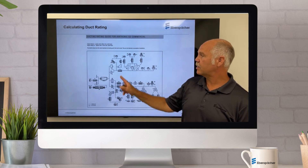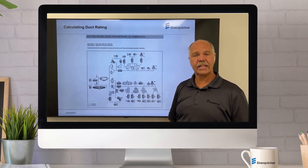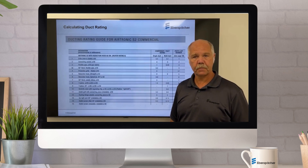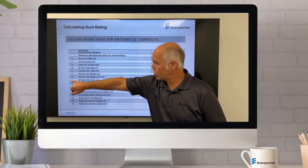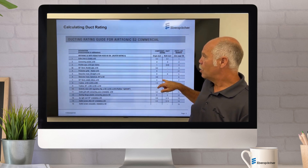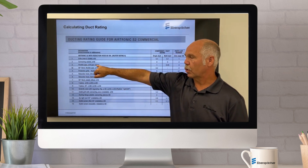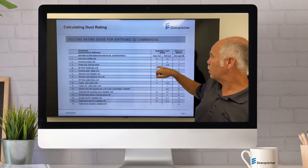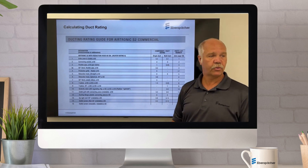You would take the numbers of the components off of a napkin sketch that you do prior to your installation, carry it over, and follow those numbers associated with the back pressure ratings. So as an example, if you had 60 millimeter ductwork, you carry it over — single duct is a 1, and past a branch would be multi-duct, which would be 0.25.